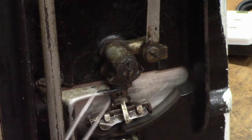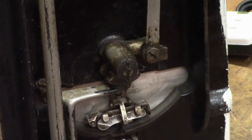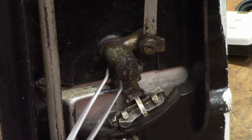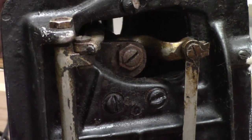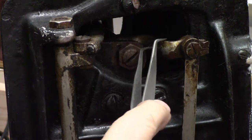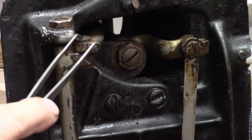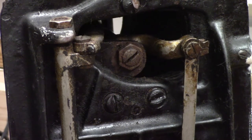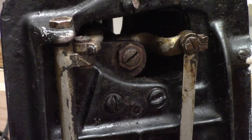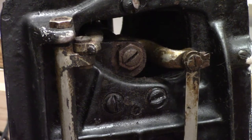The Pitman that drives the vibrating shuttle, although it does move smoothly, it is very, very gross. The shuttle carrier too is filthy. The top of the machine is pretty grody - there is a lot of gross stuff up here. The main shaft that moves the vibrating shuttle is filthy. The fork shaft that drives the feed dogs and engages with the cam for the screw-type stitch length adjuster - the stitch regulator - it's disgusting too. Although everything moves nice, it's just gross.